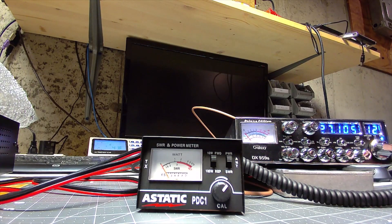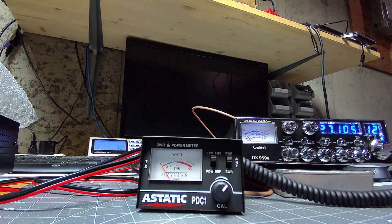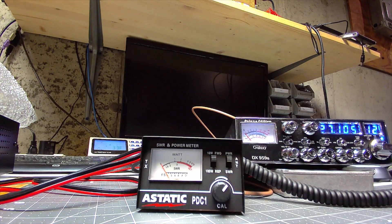I'm talking basic triage. I know I'm modulating, I'm reading 3 watts on the radio, I'm hitting 12 watts PEP. I could go hook it up to my O-scope or my true PEP meter that uses a battery — that's a whole different video.